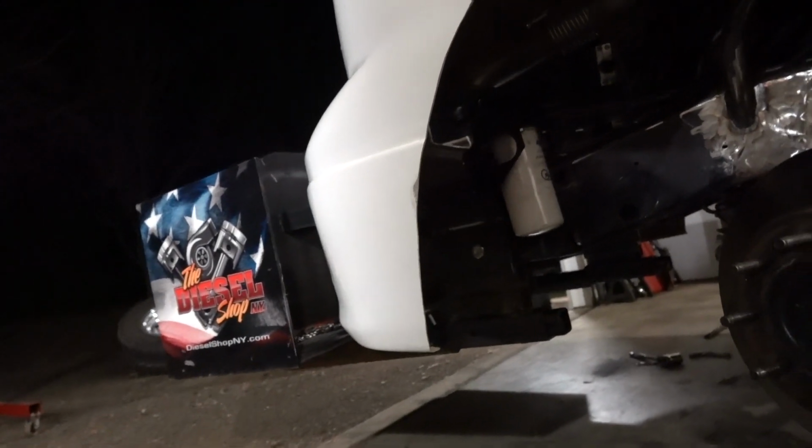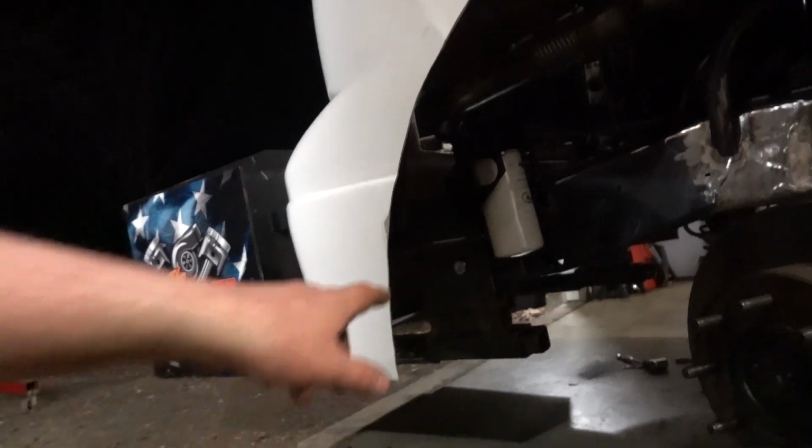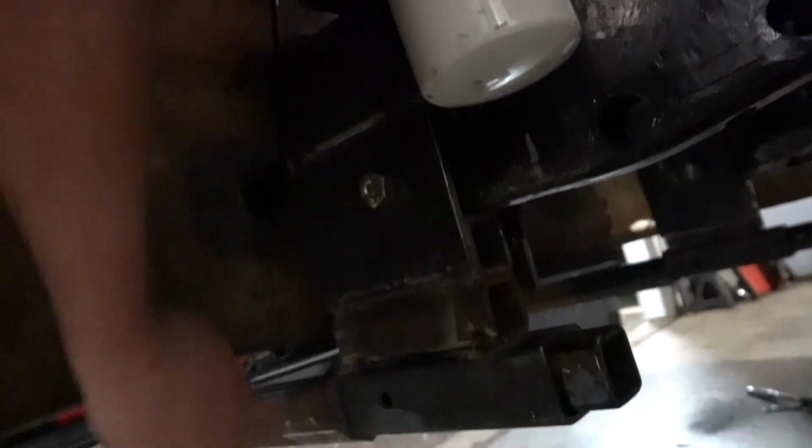Also, I got to figure out where our bolts are going to go because I'm going to do at least 2 more bolts down here, 2 more bolts down here on the opposite side. I also got to put a piece of 5/8 plate in here, and probably another 3 up here somewhere, or another 2 at least. So we're going to add some more bolting. I think it should be plenty strong enough. We got 2 pieces of 1/4 inch angle overlapped, and then we'll have like 3 3/4 inch bolts and like 2 1/2 inch bolts on either side. Maybe it's overkill, doesn't matter. It's all weight in the front of the truck, and that's where we want it.